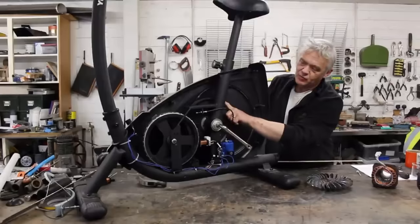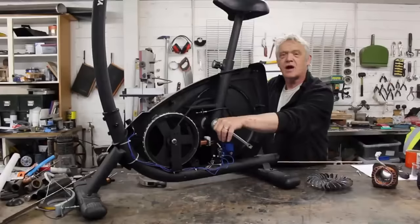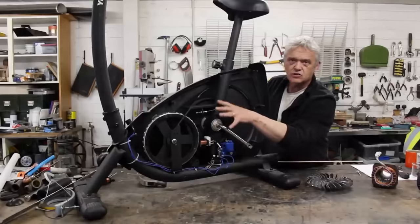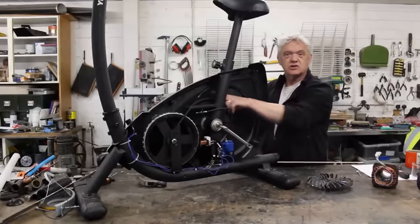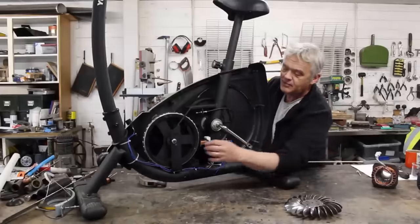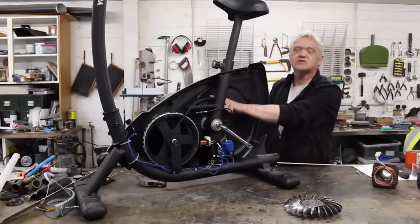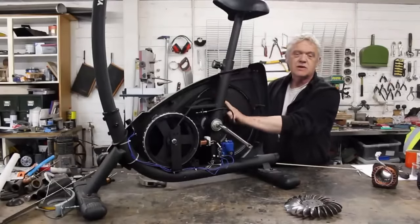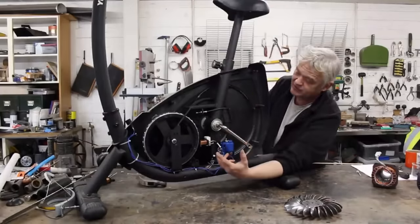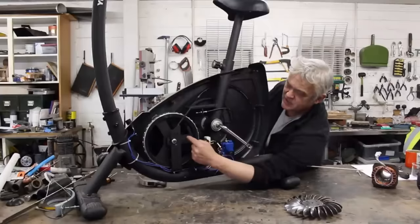After that we've got this: a big pulley wheel and belt, which actually represents a gearing system. Here I'm putting in mechanical power — my legs have relatively high torque but slow speed, and the bit that generates electricity works much better at high speed. So I need to turn that low speed into high speed, and for that I use this gear section. It's exactly the same with a turbine. Remember, generation is a function of speed — the more speed we can get, the better. We always have a gearing system to do that. Component one: mechanical input. Component two: gearing system.